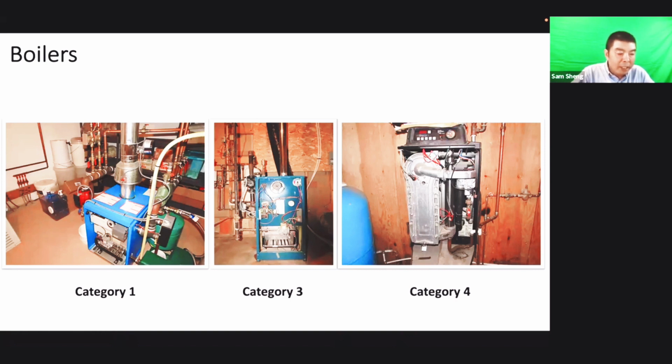Yeah, a hydronic heating system. You will have a heat generating device, like the burner, so it gets the heat from the burner. And the circulating pump, the water pipe pump. Sometimes there's one or sometimes there are two. Sometimes it's only one for the supply pipe, and another is the return pipe. It's a circulation pipe.